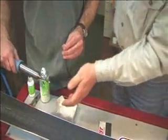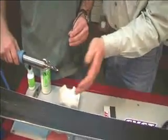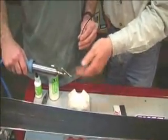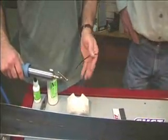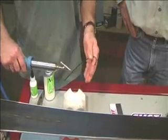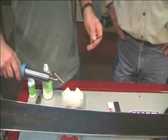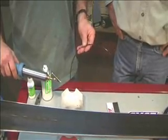So when you turn your welder on, Ed, you're going to know that it's at operating temperature when you can't hold your finger in front of that barrel for more than about a second. That's correct. You also want to start it at least at about middle range on the temperature setting. Yes. About a 5 to start with, and you can go hotter or colder.